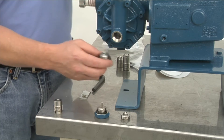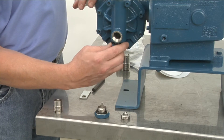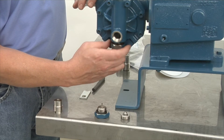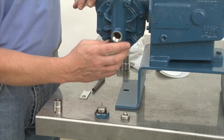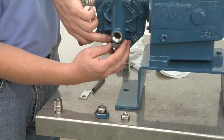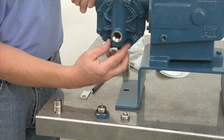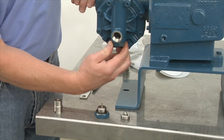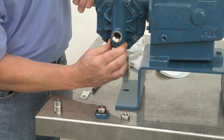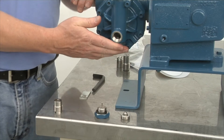Now the suction cap — start the thread. Once you start and get close to tightening, there's a little groove inside, you'll feel it. You'll feel the O-ring go in. You don't want to pinch it. Once you're in, you'll know it. If you're pinching it, you'll also know it. You obviously get a wrench and tighten that down.